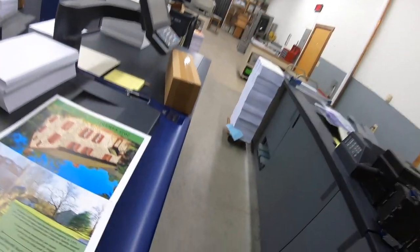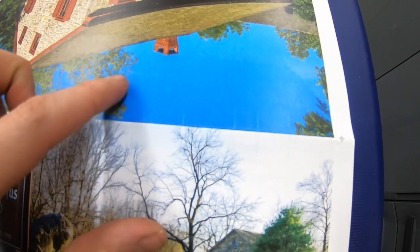We're having a little bit of a problem with the 3700. You can see these line marks that are showing up. I can tell by the look of the mark that it's happening before the paper goes through the fuser and the toner melts, because the toner jumps across onto the paper and is just held there by static electricity for a few inches before it hits the fuser. It's probably buckling the paper and rubbing against something, which agitates the toner and makes those lines appear. So I immediately thought it's either something with the transfer or something with the fuser causing the paper to move at different speeds and buckle.